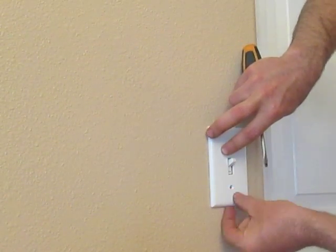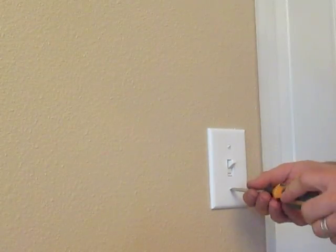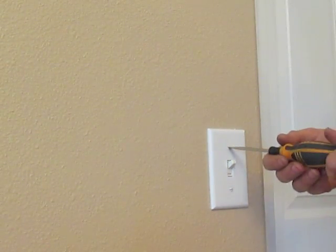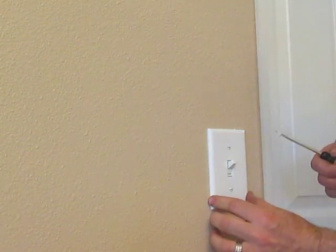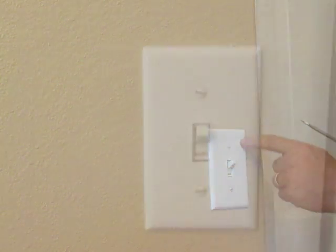After I see that there are no openings, I'll take my cover and get it set into place. You're going to have to rack it around a little bit to get that foam underneath there. Be careful not to tighten them too tight — with the foam under there, tightening the covers will have a tendency to crack them. And it is done.